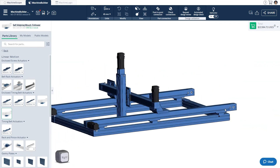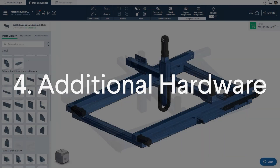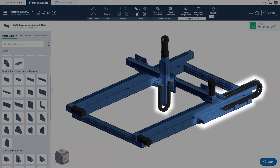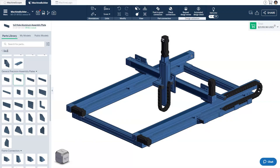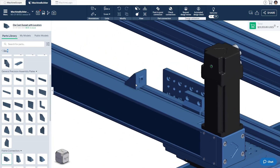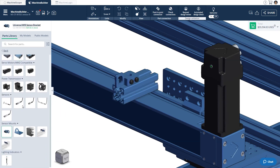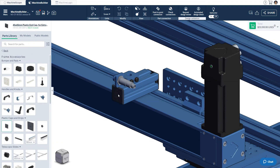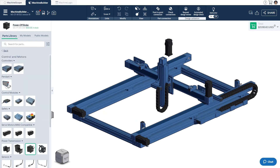Part 4: Additional Hardware. Now that we've covered the basics of designing a 2-axis, a 3-axis, and a base frame, we'll go over the components that should be added to your design to ensure the smooth operation of your gantry robot. First, cable drag chains should be added to a system that has cabling that travels with an actuator gantry, to ensure that no cables are caught in the machine during operation. Second, if the travel of one of your actuators is shortened due to an overhanging part or smaller subframe, it is important that you reposition your over-travel sensors to prevent a collision. Finally, any vertical axis should include a power-off brake to prevent the actuator from free-falling should an e-stop event be triggered.